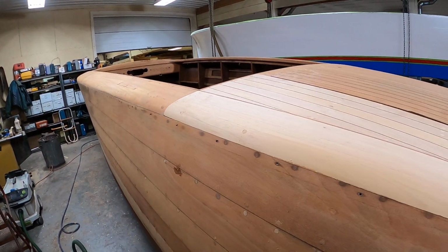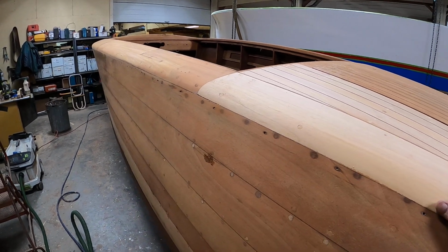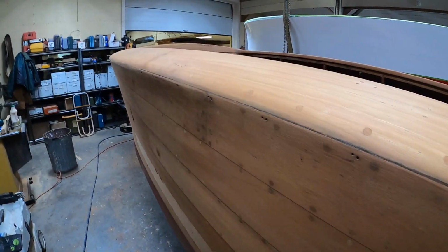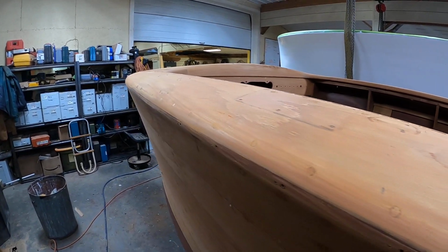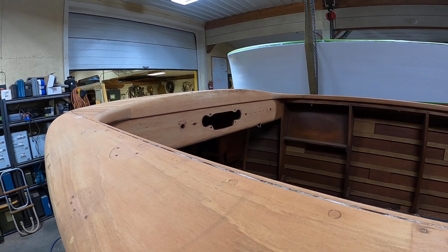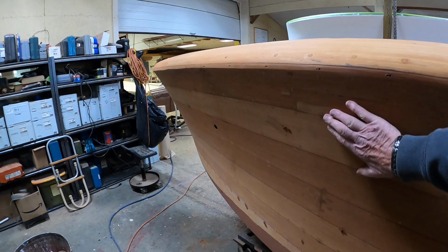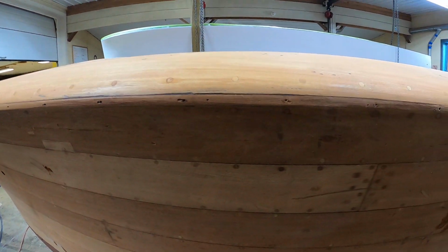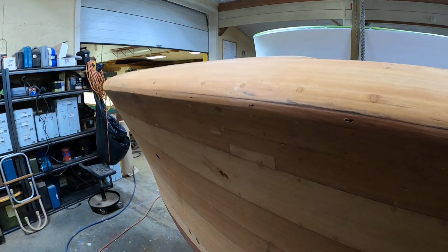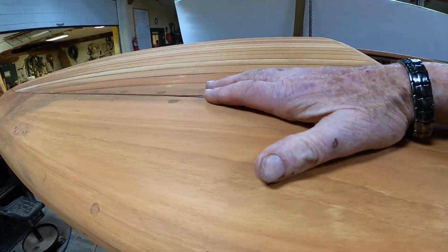So Joe was able on both sides to find some Honduran mahogany that matches as best we can the grain patterns that were already on both covering boards. The dash panel and surround above it need just a titch more sanding. And we've been in the process of trying to repair all the gouges and dents and hurts on her hull sides, cleaning out rot with Dutchmen on her decks.